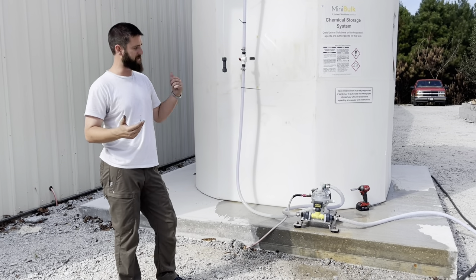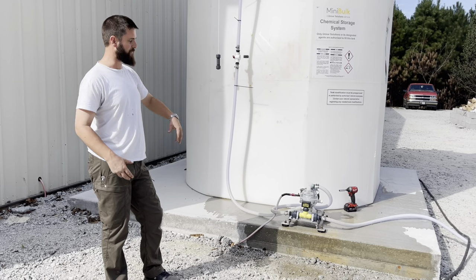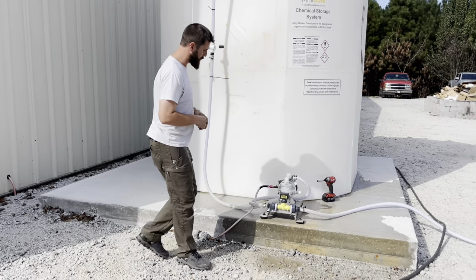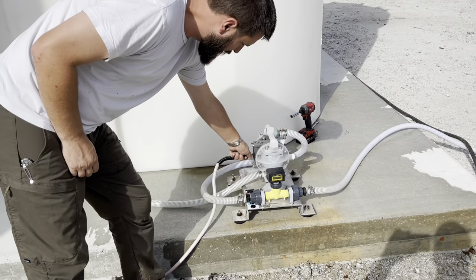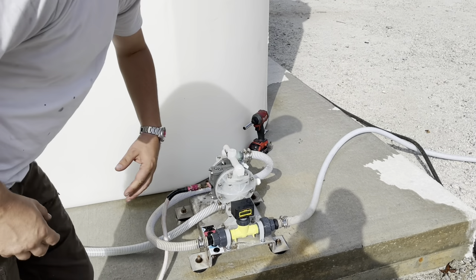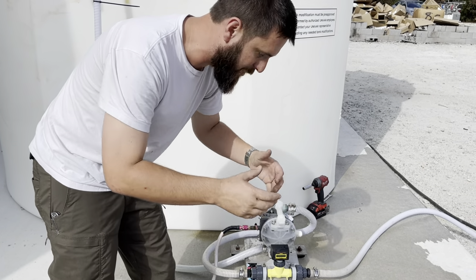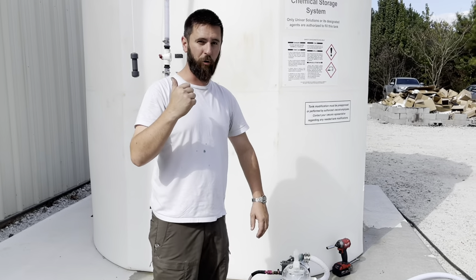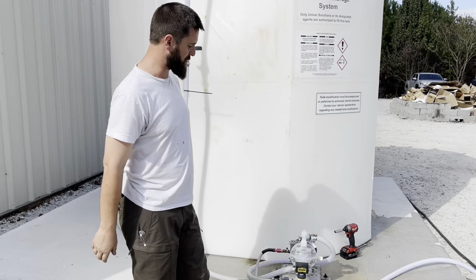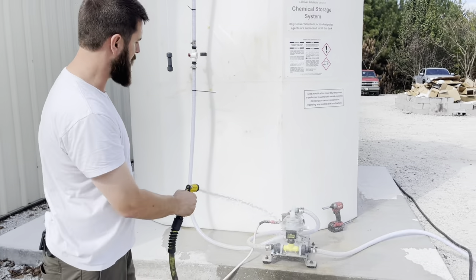Let me show you — we're going to go inside. This is our third one of these pumps we've gone through, which is very stupid because we could have bought a compressor for the amount of money we've spent on pumps. What happens is if it gets too much air — and this is a common thing that can happen if you're running this kind of setup, even on a spraying rig in the field — too much air comes in. We'll power it on — got our air lever right here. It's spraying bleach out. Between this piece and the body, the gray part, there's a rubber seal, and that seal has blown out because it was getting way too much PSI. So let's go inside. We already took our old one apart and kept it for parts, and we're going to scavenge and see if we can put this one back together. Keep everything hosed off because there's going to be some bleach coming out.